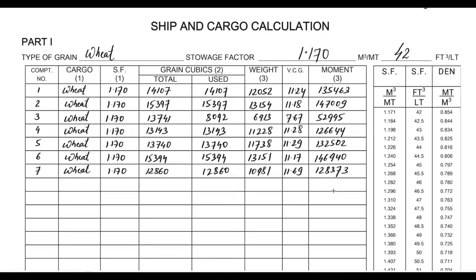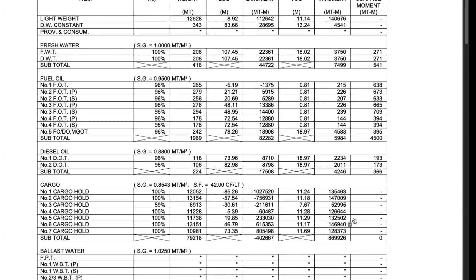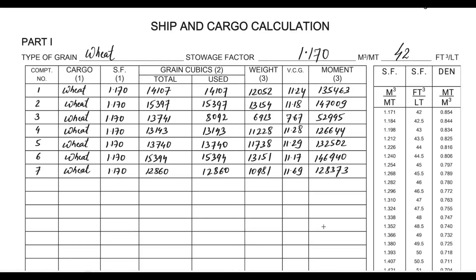I've put it in for your reference. The moment generated is by the cargo hold, not by the cargo itself. The cargo hold moment — that is the heeling moment — is a different concept dealt with in another part of the NCP form. As of now, the cargo hold is generating a vertical moment corresponding to these values. We will just pick up these values and put them in the NCP form.